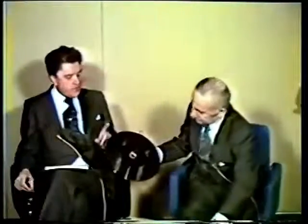So the significant thing that has happened since that last disc is you've moved now to a new situation where you've got a much simpler disc that can be produced on standard audio record pressing equipment, and in a standard audio plant. When you say standard audio equipment, it's with some minor changing in the tooling, and I'm not implying that the same press would be used interchangeably for audio and video disc, but it is an audio record press with minor modifications. Right. By the way, it can use the same steam plant.